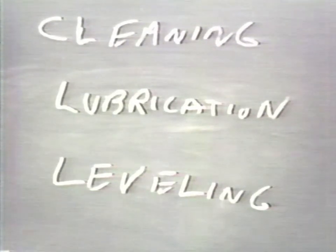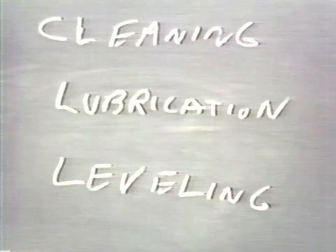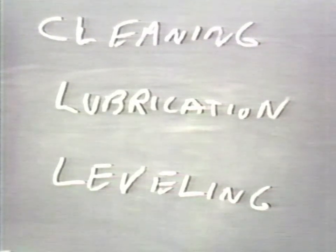Magnetic particles can accumulate on the surface of the magnets. Open the magnets and clean them with masking tape. In some environments, combinations of gaseous chemicals can cause solid deposits on balance parts. Wipe with a soft cloth, but be careful about wiping knife edges with other than non-abrasive materials. Lint-free lens tissue is acceptable as a wiping material.